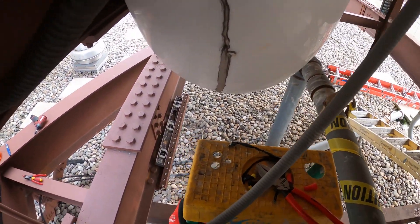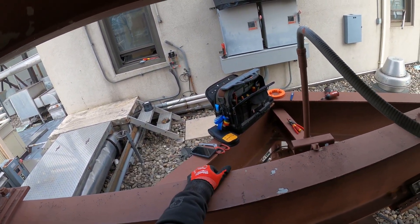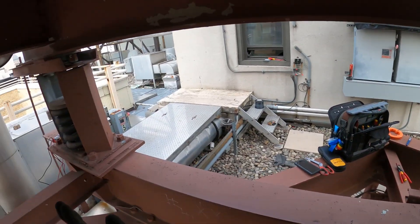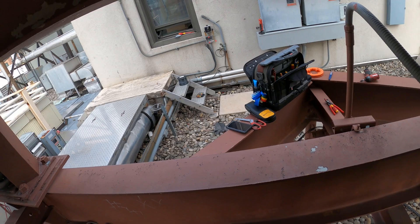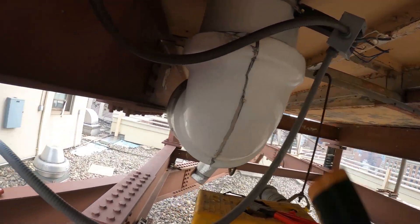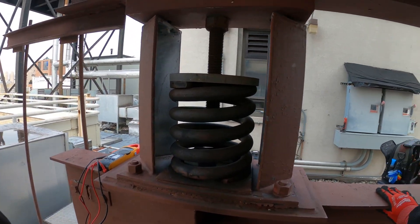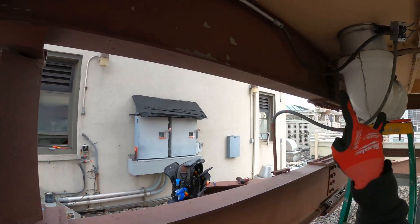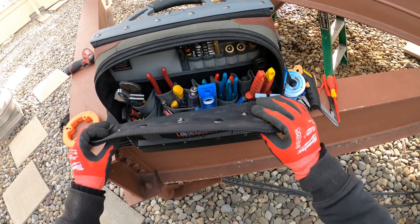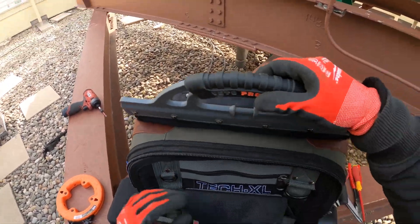So to wrap things up, we had a short in those wires — we fixed that, and now the breaker doesn't trip anymore. We have 120 volts everywhere, but we're only really pulling amps from over there. We're not getting amps here and we're not getting amps here. So we found a short and we have two bad heat traces that need to be replaced. If anybody found this video interesting or helpful, please drop a like, comment, and subscribe.